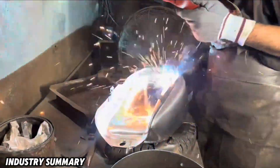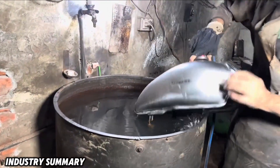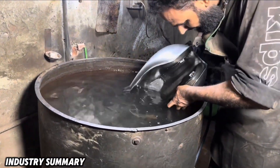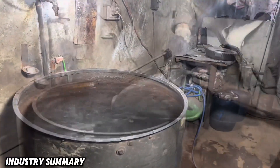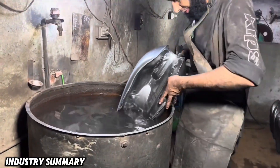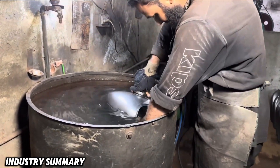In the final stage, the area for the fuel pipe is welded. The only test performed after manufacturing these tanks is the leak test, which is conducted by applying high air pressure inside the tank under water to ensure that the product has no leaks.